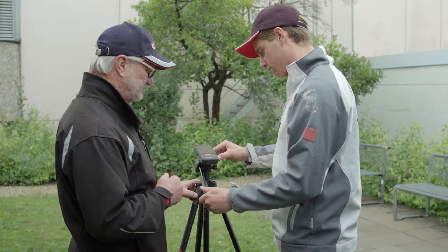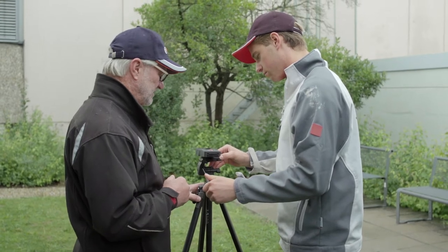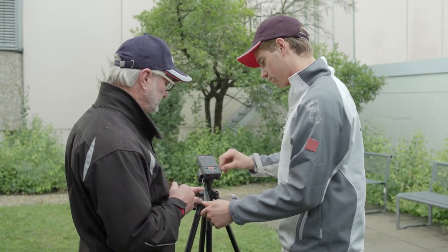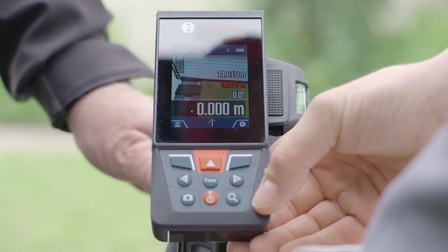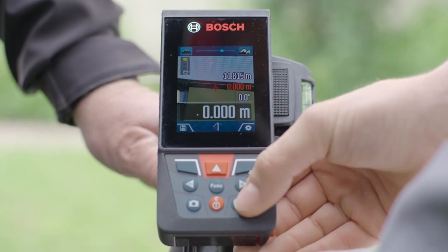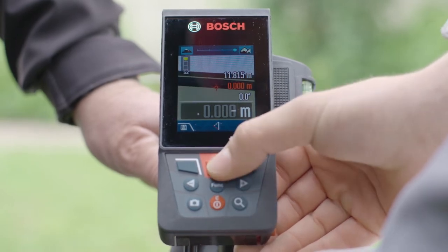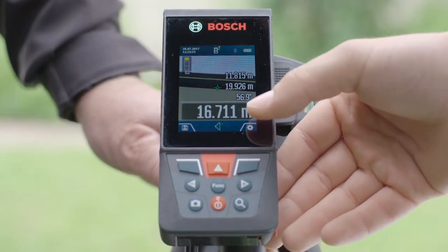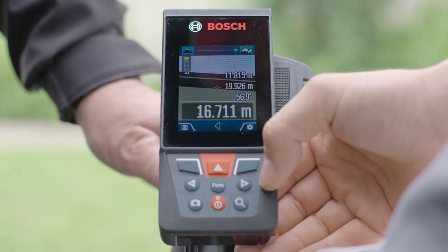Find the lowest measuring position. You can aim it precisely. And now do the same for the highest measurement point. Now we can take advantage of the zoom function. See how the image gets bigger so that you can see it in more detail. This allows you to control the measurement point with even greater accuracy. Now you have the measurement result and you can see each individual photo taken, with every measurement image featuring the date and time. You can then process these further on a computer.